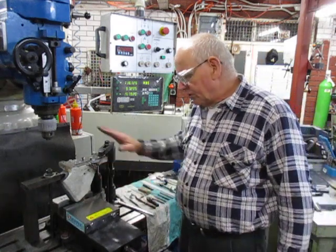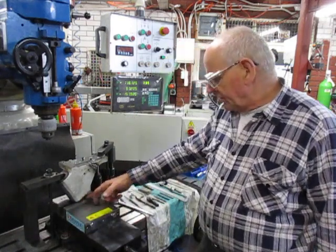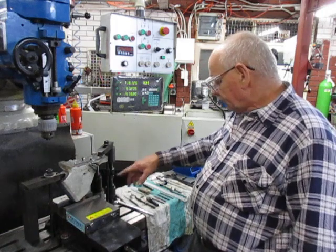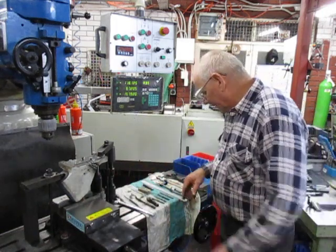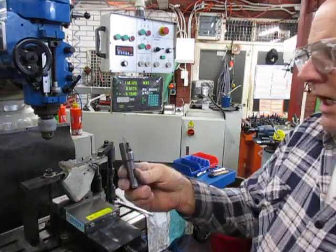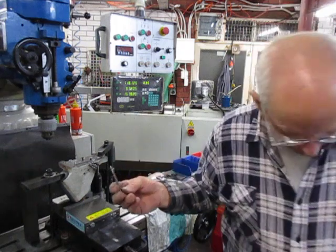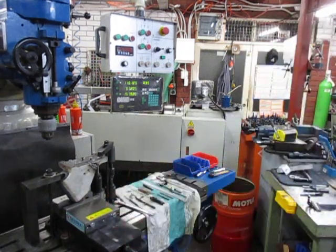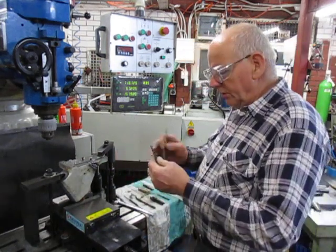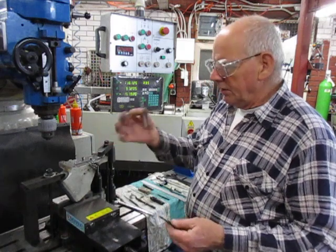So the tools we've used here, of course, is the vise. We've made this spigot. Our normal clamps. I've got some extender clamps here and a couple of adjustable trees. We've used our centre marking, our carbide tipped centre. We've then drilled with this, which is 6mm. All the bolts we've made are 6mm. So I've drilled them down with a 6mm tapping drill to the tapping depth. We've then cleared the top area of the plate with a 6mm clearance.